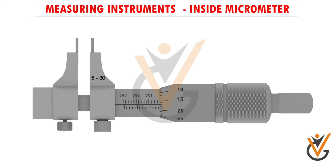To read this, you have to observe the scales from this side. If you observe, the division number 20 millimeters is here — this division is not 21, it is 19, 18, 17, and this is 16.5 millimeters. The division which has been covered is 16 millimeters, so the main scale reading is 16 millimeters. The division above this baseline is 17 millimeters.